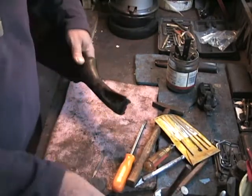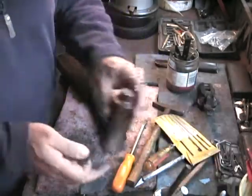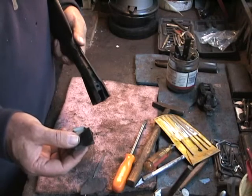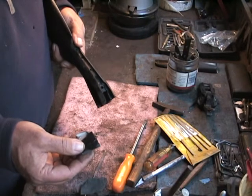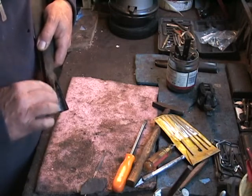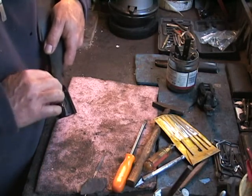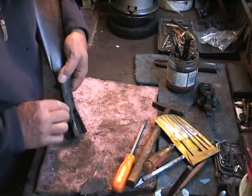You may wonder whether this stock will be sufficiently strong to be usable. Normally the answer is yes, because super glue is actually stronger than wood, so the parts that were super glued back together again are going to be pretty strong. What I'm doing is putting a little bit of dilute linseed oil — it's got to be boiled linseed oil otherwise it won't dry — and I diluted it one-to-one, or even one-to-two parts, with mineral spirits. That makes it more liquid and it dries faster, so you can put successive coats on each day. It also works into the wood better and is better absorbed. This is 180 grit — I'm just cleaning up the areas that need it.